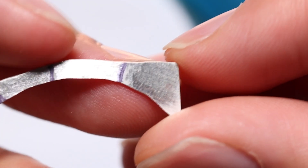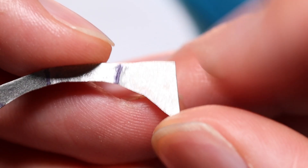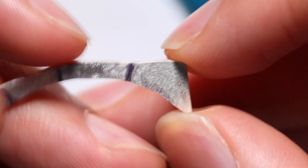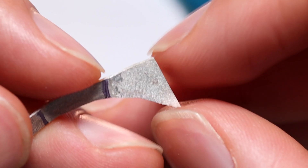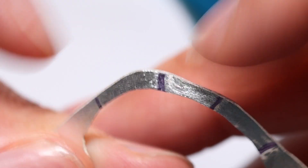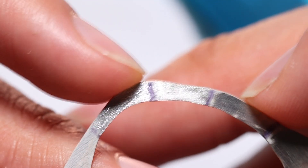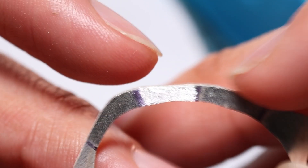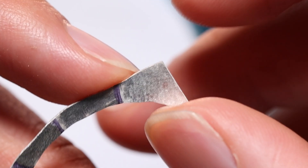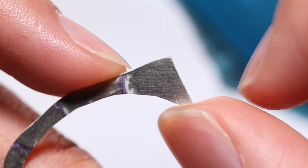Actually quite interesting, particularly with the silver, because I think I will use that. It is very annoying to use the sandpaper drums and just chew through them instantly. Working on a pendant or something, I would much rather get it to this point and then just maybe do the higher grit sandpapers to get it a little bit finished off and then hit it with that final polishing compound. Compared to the sandpaper, I actually think these burrs would be much cheaper in the sense that they're not wearing anywhere near as quickly. I don't think the set of four is overly useful though, because I don't think you'd ever scrub back to the 200 grit - that's way too coarse. Unless you're really trying to get rid of some terrible solder spots, like you've put way too much solder on your pendant and it's leaked through. Then you could maybe go 200, 400, 800 and then up to the 1500 and switch over to the high grit sandpaper. Probably best just not to make a mess of your soldering in the first place. It's best to just use the minimal amount and get it to work and flow, and not have to scrub up too much.